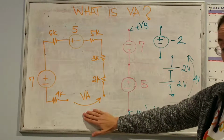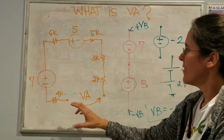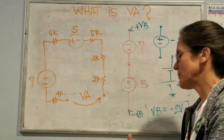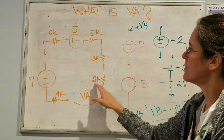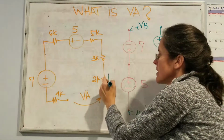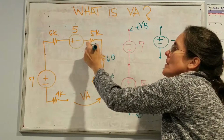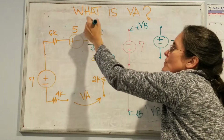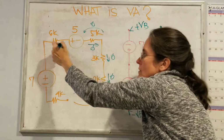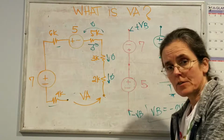Maybe the jump to here was too high, but this is similar from my perspective, the same, but I realize the difference is the resistors. And these are 2 open nodes, and again, the current here is 0. Current is 0. There is no voltage drop. Current is 0. Voltage drop is 0. 0 and 0 because there is no closed circuit here.